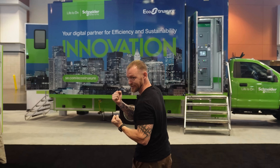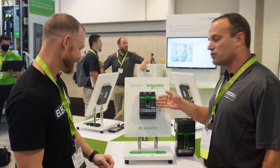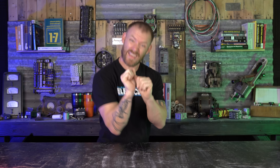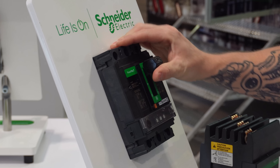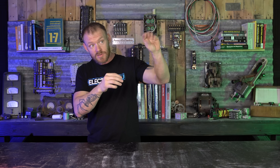The last stop that we made was Schneider. I'm always looking to see what Schneider is doing — they're just innovating the crap out of everything materials wise. The first thing that I noticed was these new breaker handles. A lot of the molded case circuit breakers out there used to have really skinny handles that were a pain to flip. So they added these new blocks on the ends of their handles which make it so much easier to flip. And they made them so that there's an indicating light on them — so if they trip, it'll actually blink at you. If you're in a dark room with tons of breakers everywhere, you just see this little bit of flashing and you know exactly where to go. I find that is incredibly helpful.